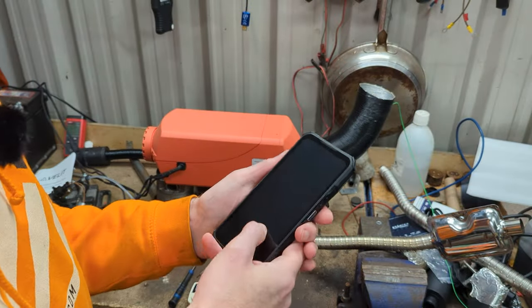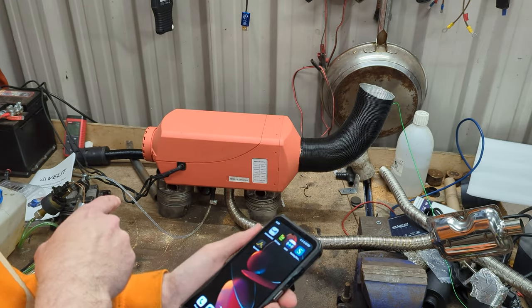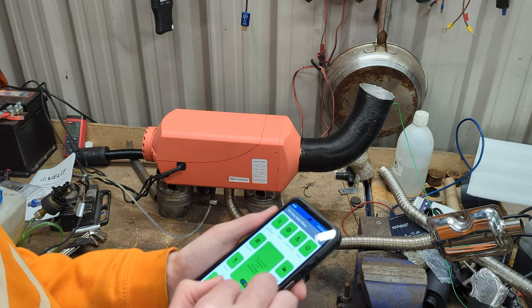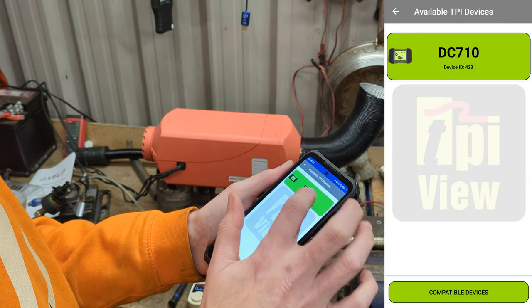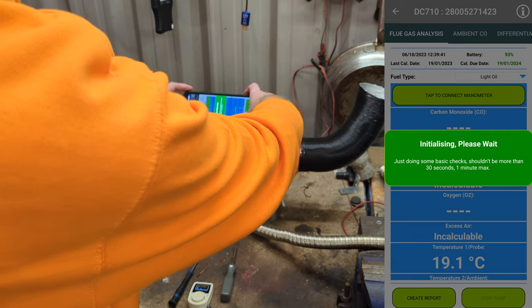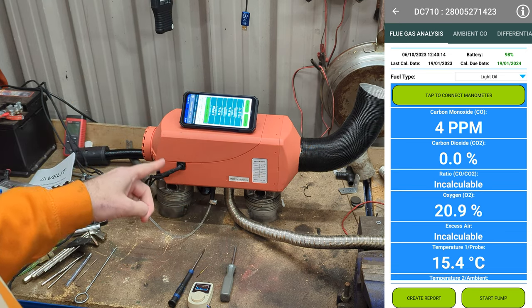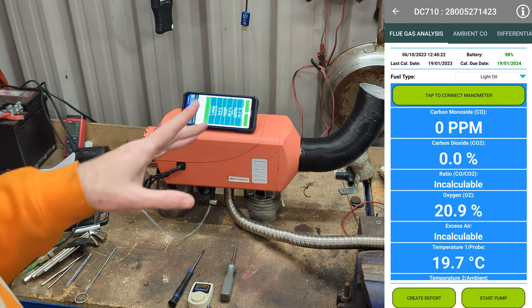While it's starting we'll fire up the DPI view app. The fuel pump is pumping. Let's fire up DPI view and the screen recorder. While that's initializing, the heater is lighting. Once it's lit we'll put the probe in the exhaust and get our carbon monoxide reading on low, and then we'll get a sound analysis and a frequency analysis. Then we'll turn up to high and do the same.